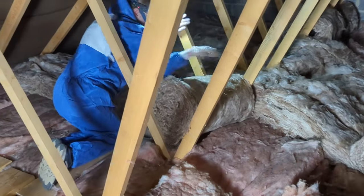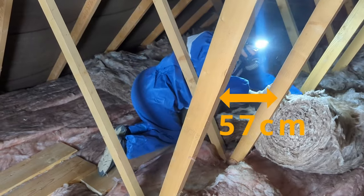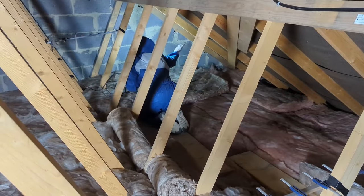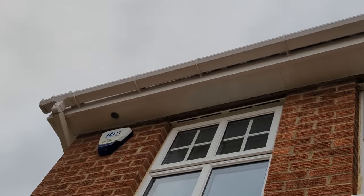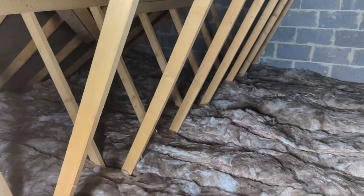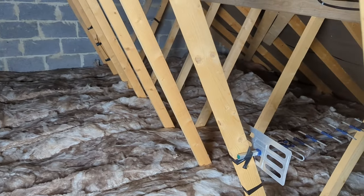Begin at the eaves and work back towards the middle of the loft space and hatch. The length between our roof trusses is approximately 57cm, or half the width of this Knauf insulation. While still in its packaging, use a saw to cut the loft insulation to the desired length. Unwrap the insulation and position its edge at the eave edge. Given this is a top-up layer, I'm positioning this approximately 50mm away from the eaves to allow adequate ventilation from the roof soffit. Unroll the insulation towards the middle of the loft, gently agitating it to expand to its full thickness. Repeat on the other side and make sure the two ends of the loft insulation are butted together with no gaps until the whole loft space is covered.